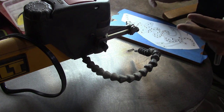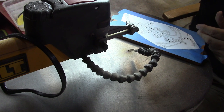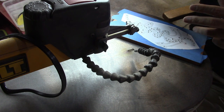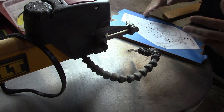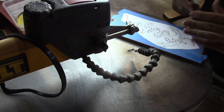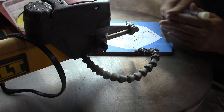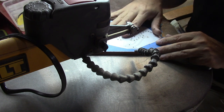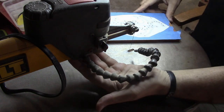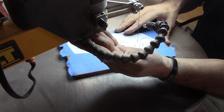Okay, so I've resawed the board to make the backer board, and I have it clamped to my workbench to help keep it from warping. And then tomorrow I will glue that up in a panel. So it'll be a day or so before I can work on that. I've got the main piece though glued to the board, and the pattern glued to the board. I've got all my starter holes drilled. All right, we are using a Pegas modified geometry reverse tooth number 3 blade.